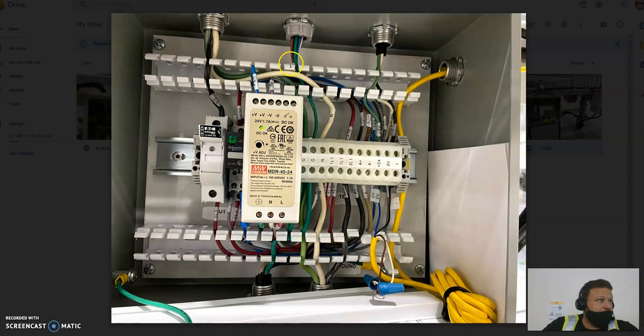You have your ground wire that comes to the terminal block — a ground wire that gets sent to the speed box and sent up here. But the main wire we really care about is our 120-volt line. That 120-volt line comes straight into this Bussman fuse, goes through the fuse, and comes out the other side as L1. L1 loops around to the bottom, then gets jumped right here. One L1 leaves and comes to our 24-volt adapter; the other L1 comes around and goes to the bottom of this relay.